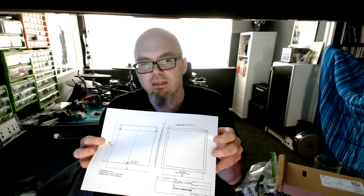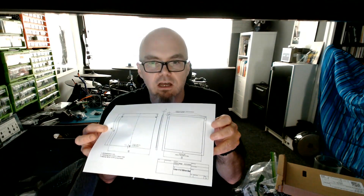I'm getting cast aluminium — cast, not rolled — because if you heat and cool rolled aluminium you're going to end up in all sorts of hell because of the thermal expansion and contraction. And that goes back to the really good design elements of Voron. That's one of the technical drawings from the Voron Design GitHub that measures out exactly where you want to put the holes for your bed. I've got a pillar drill so drilling the aluminium isn't really going to be an issue for me, though I know some people may find that a little bit intimidating.